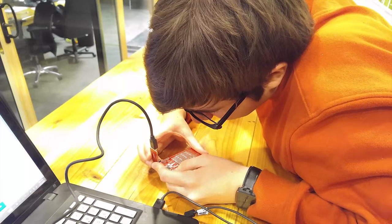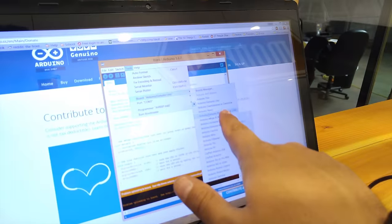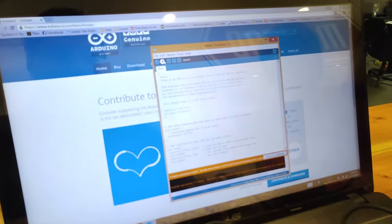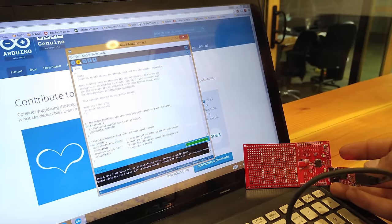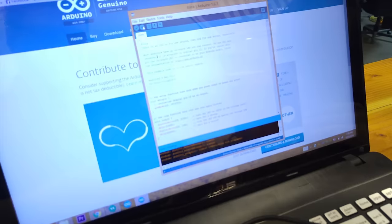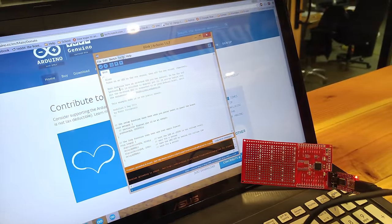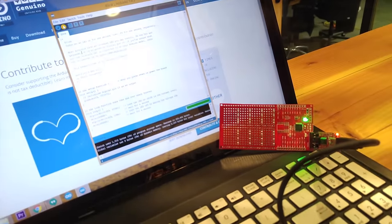Try COM3. I'm pretty sure that's not what the Uno is at. ATmega328P — how about Arduino Mega or Mega 2560? Try that and then try to upload it again. If not, try COM5. This is a really small program to take this long. Try COM5 instead. We'll go ahead and upload again — same problem. Well, since we're already on that board we might as well switch to COM5 and see if that works.